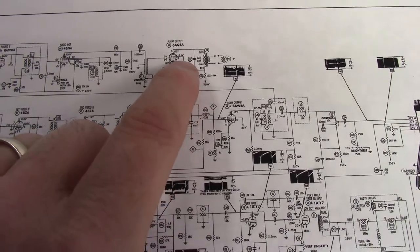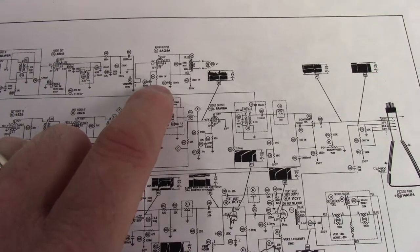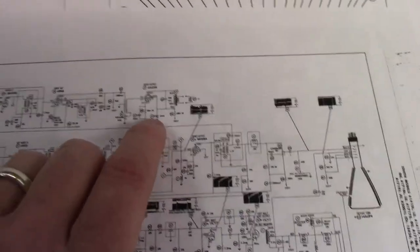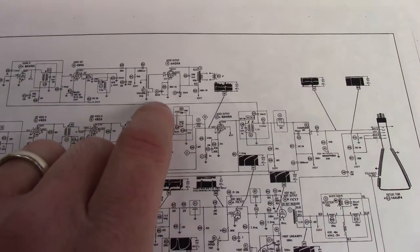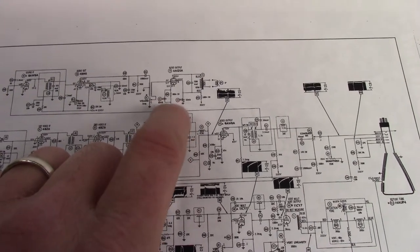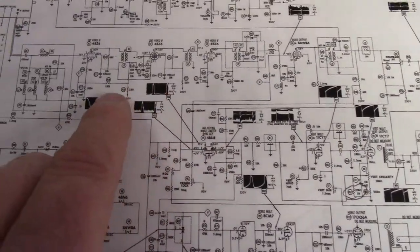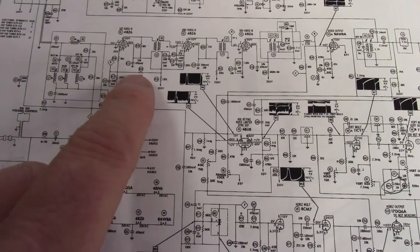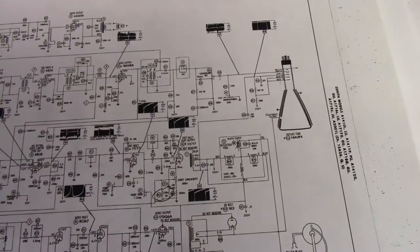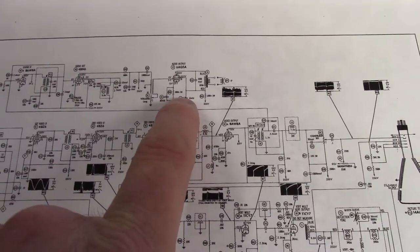This is the boost filter and that sounds right — lots of highs, no lows, must be a relatively low value. Super high ESR here; this one's just dead. If we look at C3, it's in the audio circuit. Two sections are on the audio output tube — that probably explains why there's no audio. I'm probably going to bridge some capacitors in for now. I ordered everything for this — resistors and caps. These are higher voltage caps; I may or may not have them. It's probably not the issue with the IF.